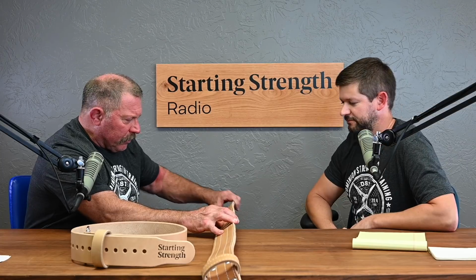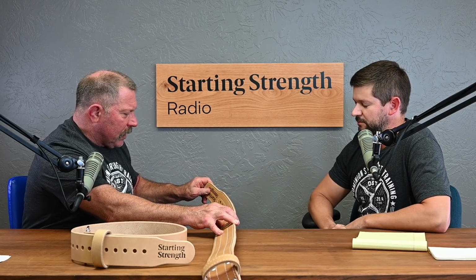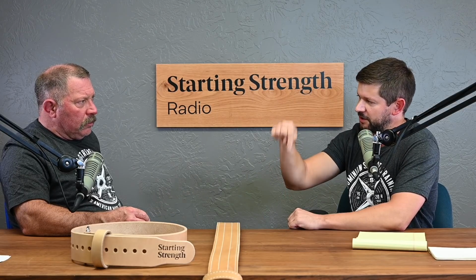How do you sew? The stitching on these things is absolutely beautiful and uniform. What kind of machine do you use for that? We've got a couple of Union Lock Stitch machines. A normal sewing machine has a single needle that punches up and down, and a presser foot feeds the work. To sew this material in this thickness, we use something called a needle and awl sewing machine. Instead of a needle coming down and punching into the work, there's an awl, and its only job is to come down and punch the hole.